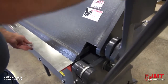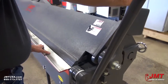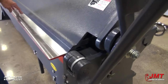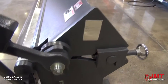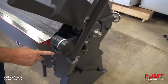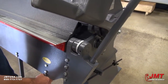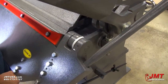So we'll show a couple of different bends that we can do here. We'll put the metal into it. Most times you can have a mark on your metal, so you're going to line your marks up and then bring the lock down and lock it in place. We'll do a 45 degree bend here first. So we'll look at the arrow here, and then this is our degrees. We're going to bring this up until the arrow meets our 45 degree mark right there.